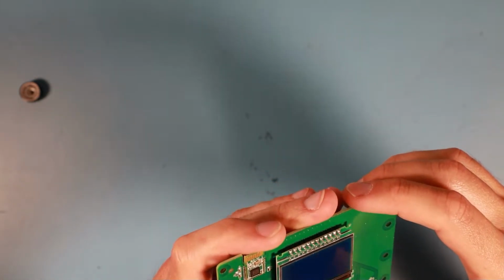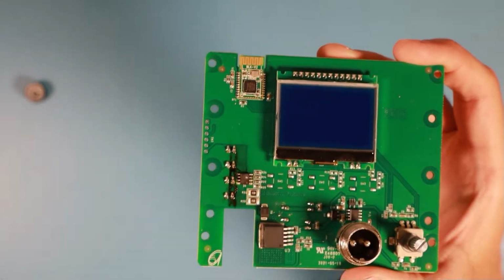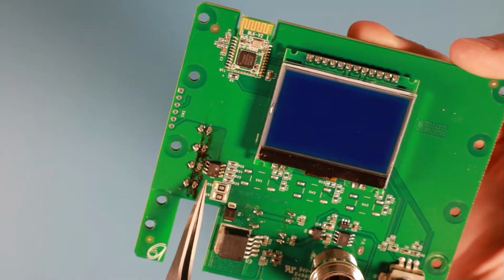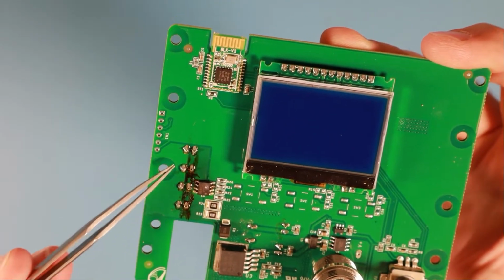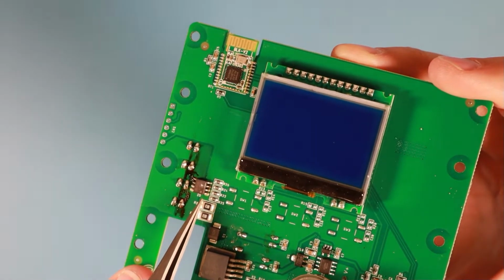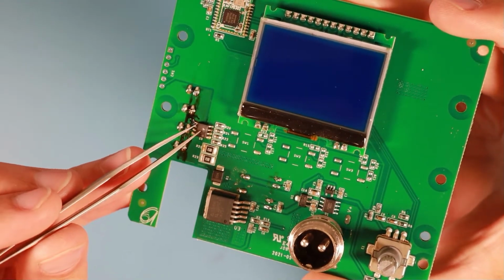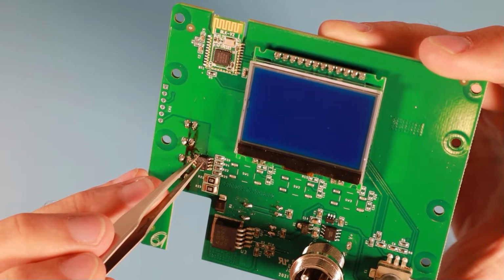Ooh. Oh man, that burned down. Whee! That really burned. You see this down here? It has a clear burn mark. And okay, I think this crustiness around here is mostly flux. But when you look at the pins and you look on the IC, it has clear burn marks. And I think this white dot on the IC might even be a point where I can, yeah, okay, I can rub this away and I can stick my tweezers in there.